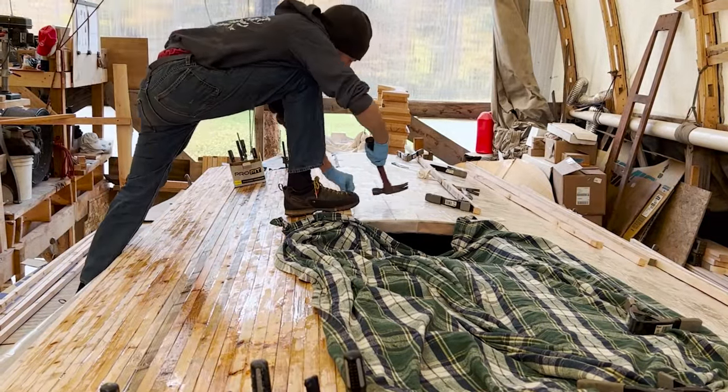So yesterday, KP and I mixed up some total fair, and we put that on the housetop. Just a tad too much. And just gave the whole housetop a skim coat, and anywhere there was knots or defects, any place we had a glue joint that didn't quite have enough glue in it, we filled that with the fairing compound. Today we flipped it, thank you Ann and Robin, and then I got it power planed and sanded. And now we're gonna wet the whole thing out.